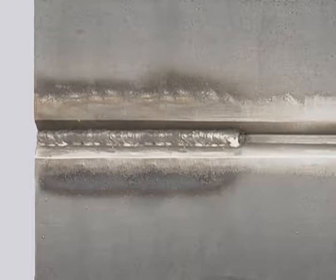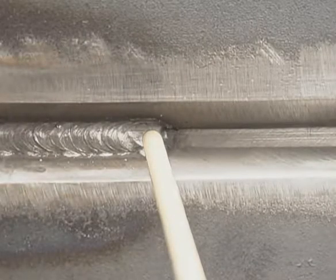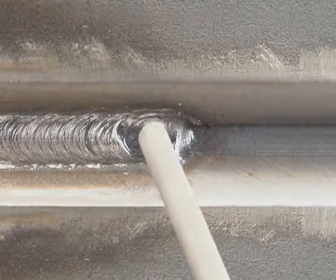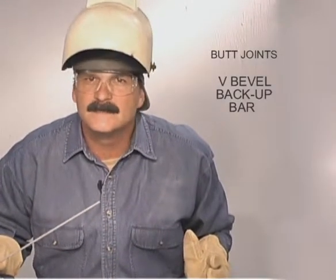Also, if the rod is angled too far back towards the weld, the molten filler metal takes the heat instead of the metal, causing the puddle to drip. Horizontal is generally not used for welding tests, but you often get them in practical situations. Angle the rod up and slightly into the weld. The bottom bevel acts as kind of a landing, helping to hold the weld, so you may be able to use a slight rod movement. Watch the top side and push the puddle up. Set the amperage to allow a fast enough travel speed so the base metals don't overheat, which causes the puddle to become too fluid. Don't try to carry a lot of metal on a horizontal — just get all the pieces tied together and keep the filler metal from sagging.